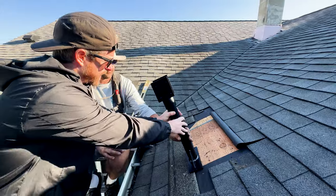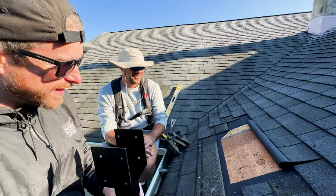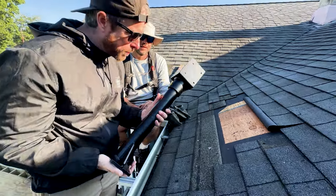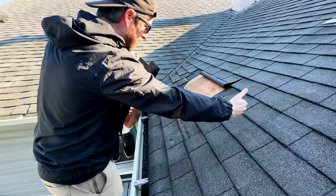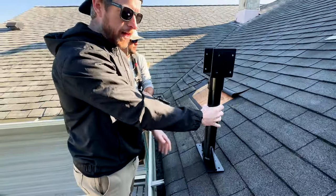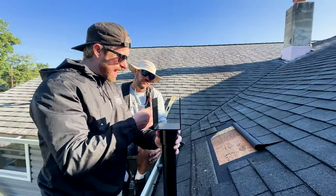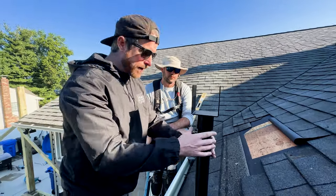All right, so we're just gonna attach it like this. Is that right? Yeah. Now what we gotta do here is remove some shingles. We are going to cut out a hole in our sheathing, and then this is actually gonna sit on top of our wall plate inside. So we wanna measure back, soffit overhang here, figure out where that top plate's gonna be, and then boom, this is gonna sit right on there, and it will accept our beam. So it's pretty sick. It's a really cool way to have half of our pergola bearing on the interior wall, and we'll show you how everything comes together.